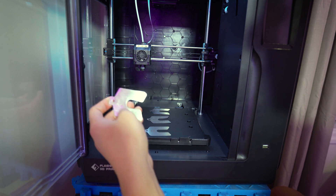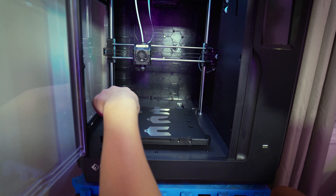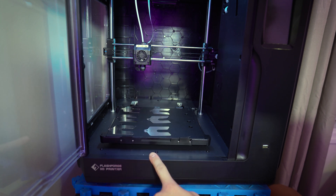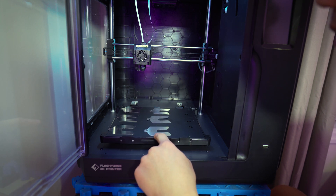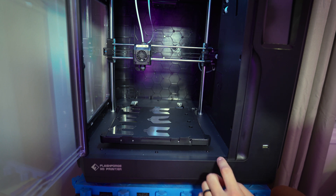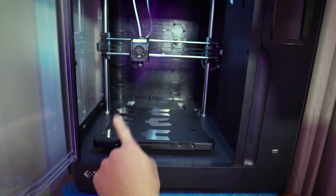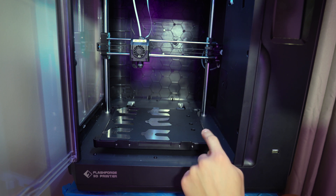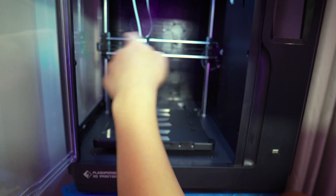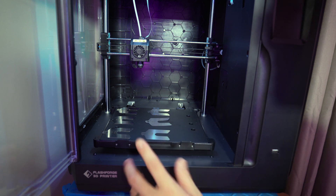On the left side, I found that the metal shim reads about 0.25 millimeters, so I've placed three of them — the middle one is 0.2 mm and the far side is 0.25 mm. In the center I've got 0.1 mm, as well as stacking 0.05 and 0.10 mm shims, which lowers the middle by 0.05 mm compared to the front and back edges. The right side has no shims since it was already higher. With these metal shims underneath, I don't need to level the bed by adjusting the screws.